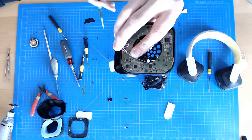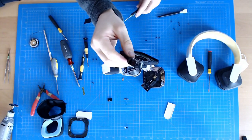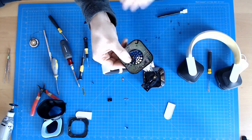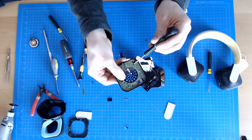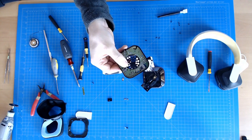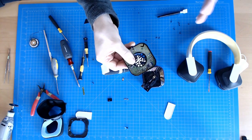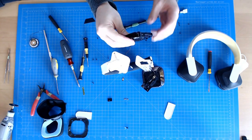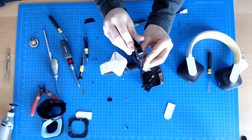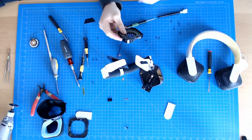Yeah. That's fascinating. So I'll break that down one more time. We have 3 different connectors on this end. We then have a pin here, which is controlling the XY position or the flat plane position. But then on this back side, because we have to have some tolerance in the manufacturing, we actually have a slider in so it can be a little bit out of spec, or within that tolerance, you'd say, on that dimension, but it keeps it from being angled in the wrong way. Because there's nothing worse that consumers notice when you get your consumer electronics and it looks like that. Right. It's a little bit out, or it's actually off axis, and it just looks cheap, I would say.